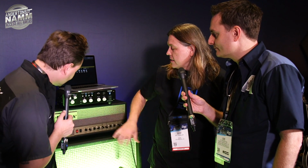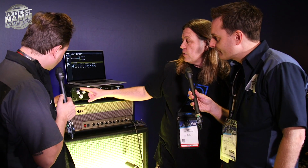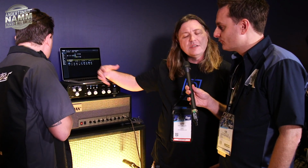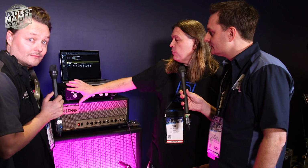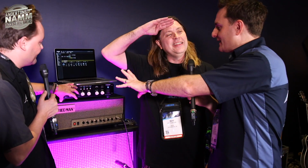And as you were saying, most of us have a master volume. Again, most guitar players aren't aware that the first tube to clip and distort is the last tube. So we want to get that master volume up to the point where the power tubes are doing something, and when we turn it down low, the first words out of our mouths are, it doesn't feel right. Well, that's because we've stopped clipping those tubes. So now you can dime your amplifier and match it so it has the right resonance and interactions. You have a continuously variable control, not a stepped control, and that right there would be enough. I'd just say thank you, I'm good to go.